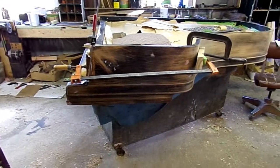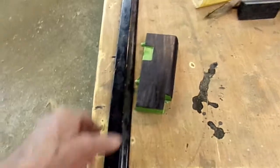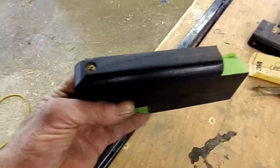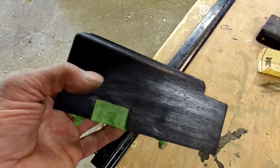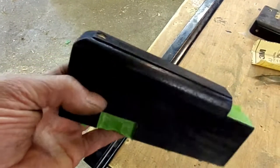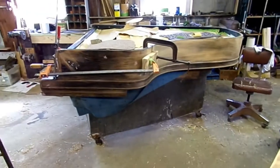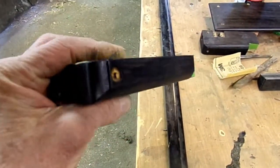We're going to take that apart today, this morning. We glued that last night. Before I do that, I want to show you this. This piano was refinished in black — it was a mahogany piano. The parts that they stripped and redid were the music desk, cheek blocks, key slip, and all the upper parts. When they sanded this down, somebody did a lot of damage with the sanding machine.